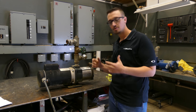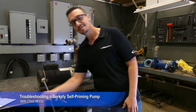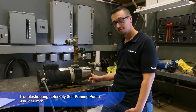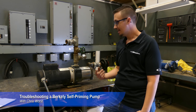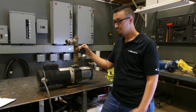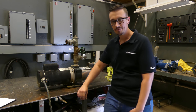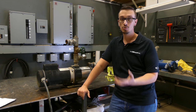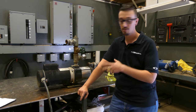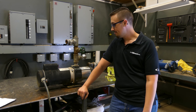Welcome back. We've got another pump here — this one is a Berkeley SSHM2, a two-horsepower multi-stage centrifugal pump. In operation it produces an immense amount of head and a decent amount of flow — all around a pretty good pump. I sold this to a customer in 2015. He claims to have about 28 to 30 feet of suction lift, so theoretically at our elevation of about 2,000 feet this pump shouldn't work at all, but it's been working for almost three years.